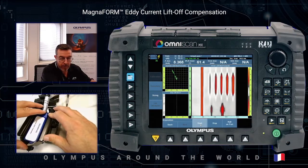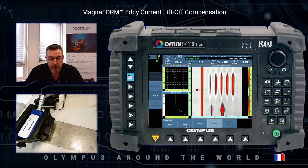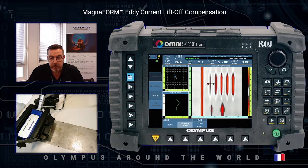We perform the full acquisition of all defects, press stop, and follow the results. We can record the defect depth value — in this case 0.5 millimeters deep. For the second one it's 1 millimeter deep, record the value. Third one is 2 millimeters deep, record the value. Then 3 millimeters, record the value, and finally the last one which is 4 millimeters deep — record the value, then finish.